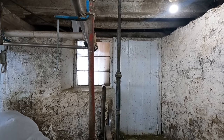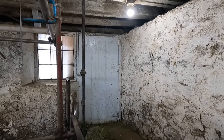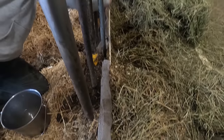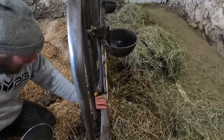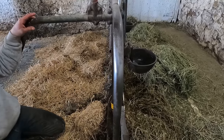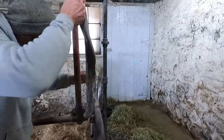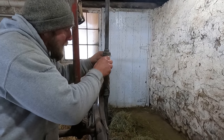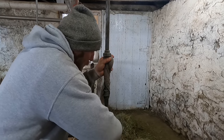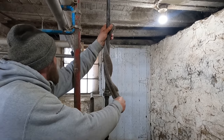So let's say we're going to thaw out this pipe here — this was a serious problem a couple days ago. You take these tube socks and lay them on the pipe with hot water. That transfers the heat, and after maybe a minute or so you move on. Wrap it up higher, and you don't have to hold it very long — give it maybe 30 seconds to a minute — then go higher. You almost have to guess where it's frozen.